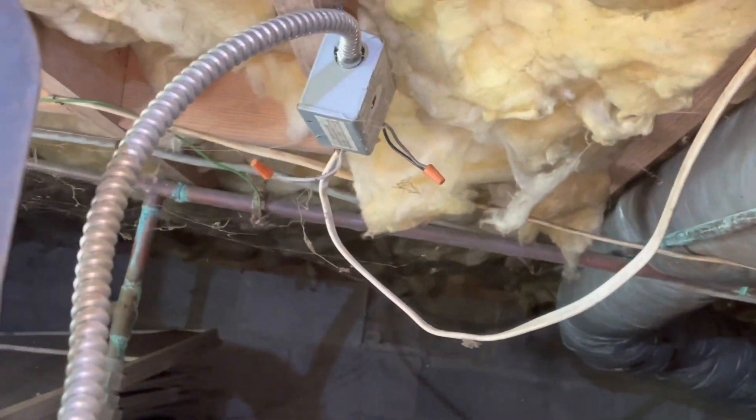I'm noticing drilled holes in the foundation blocks, indicating that there was a termite inspection done prior. There are some loose wire ends that should be in a junction box and covered with a protective cap. I'm also seeing way up in the crawlspace, probably another 30 to 40 feet away, another one of those ventilation fans — I think that's a great idea.